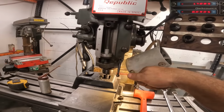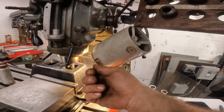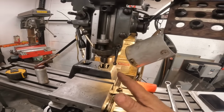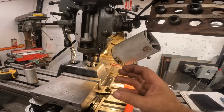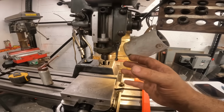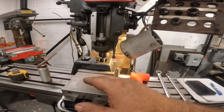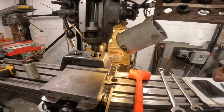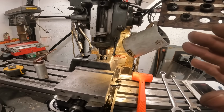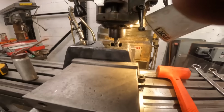What I'm gonna do is I have to cut this one. When I was plasma cutting, I wanted to make sure that the pieces fell through, which in hindsight, I should have done the other direction because I cut on an angle and I made my opening bigger than I wanted. Which is okay because this is just a test piece. The only thing is it's going to take a little bit more material to fill the void. And I was trying to limit how much more material we're going to use because my crucible is literally at its max to get to that 10-pound mark on the copper one. But this is just a test, and we're going to correct all of our mistakes on the next one.